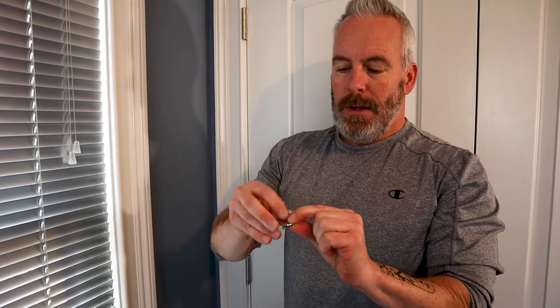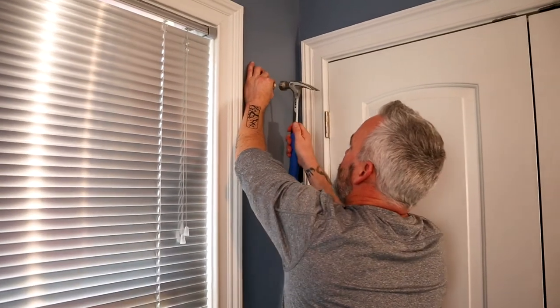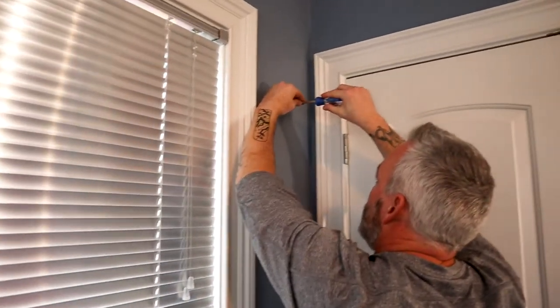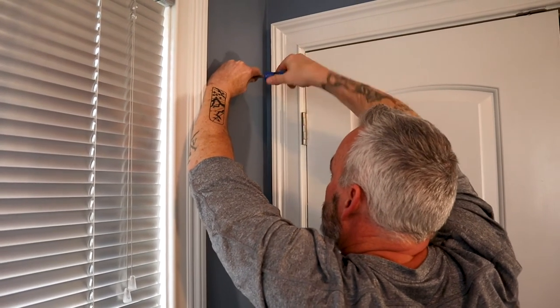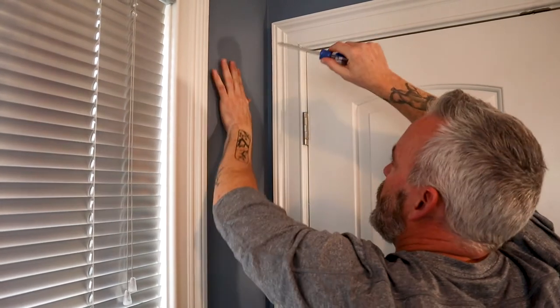Before you proceed, make sure that the screw sits all the way down in the recessed opening. I'm going to start my easy anchor, drive it up to the threads, and screw it into the wall ever so carefully. Make sure it's fairly flush to the sheetrock.